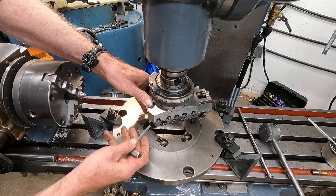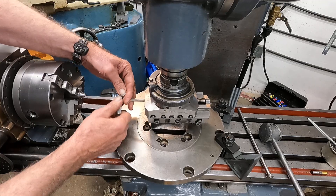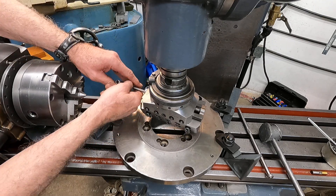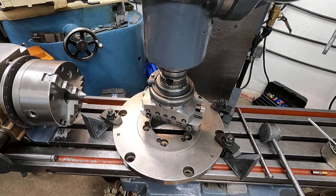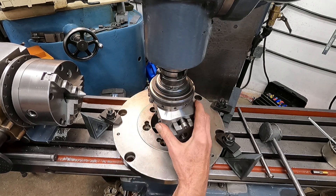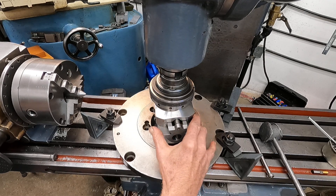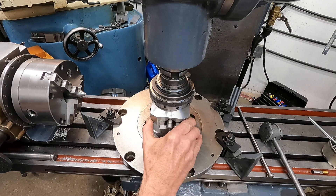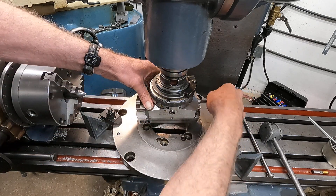The tool's right here and I'm going to crank this back. Okay, I've got it just about in the middle of the work there. I'm going to get down here and lift the table up and just get that to touch — just touch the work. Getting close. That's it. Real nice. Okay, you're just scratching.